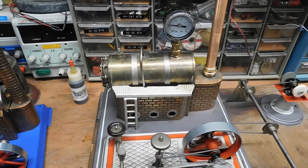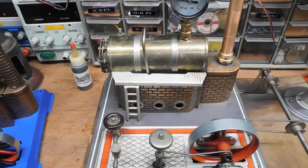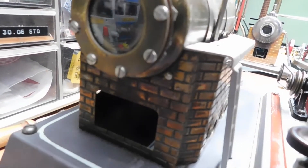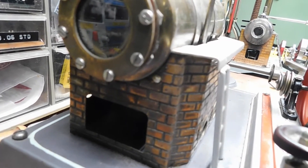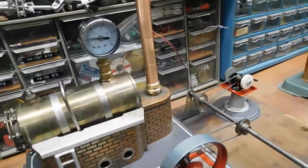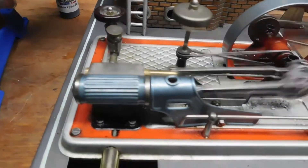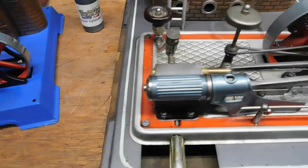Normally if you use fuel they'll run about 12 to 15 minutes. This one's electric. On electric ones you have to always watch your water level — there's a line right in there. You've got to watch the water level because if it goes down it's possible you can overheat it and unsolder all the joints that made this thing one piece. This one even opens up so you can put some cylinder oil in there, which forces oil into the cylinder to help lubricate it — which is also done on real steam engines.